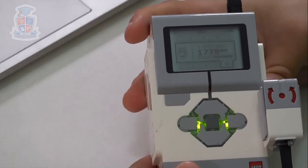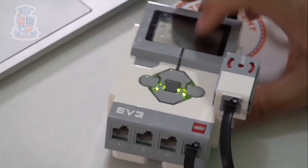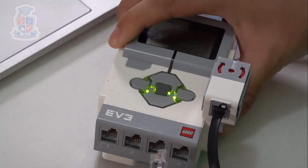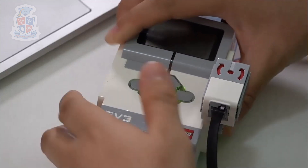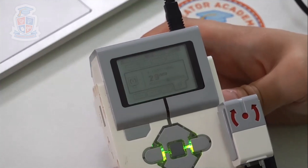There are two ways to fix this. The first way is with a hardware fix — we unplug the cable and then plug it in very carefully, making sure the robot is not moving. So the gyro is drifting, it's not working properly. We're going to keep the robot as still as possible, unplug, and plug it in again. You can see that it is still drifting, because no matter how hard I try, just plugging the cable in can cause the slightest movement that will disturb the gyro sensor.